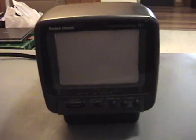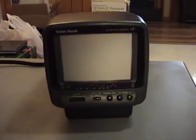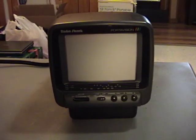This is very absurd what it's doing here. As you can see, this is not the camera — it's the TV itself. It's extremely blurry; you can't see anything. The picture is also flickering, briefly going dark before coming back. And you probably won't be able to hear on camera, but I can hear a very faint hissing sound coming from inside the set.